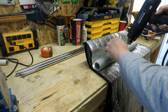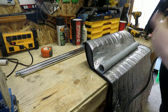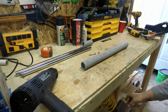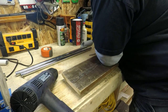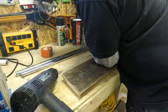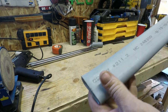You also don't want to burn the PVC. The PVC I'm using is inch-and-a-quarter schedule 40, so it's the really thick stuff — I'm sure the thin stuff might work as well. Once it's soft enough, pop it off — be careful, it's going to be really hot, you can use some gloves. Then I just take a board and put my body weight down. You can make a little jig and clamp it in place. Just smoosh this down until it sets — nice and flat, perfect for what we need.